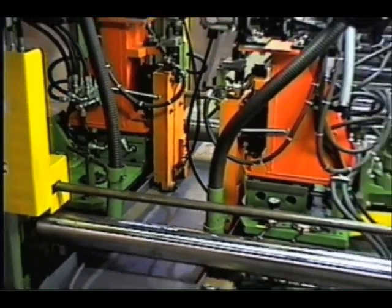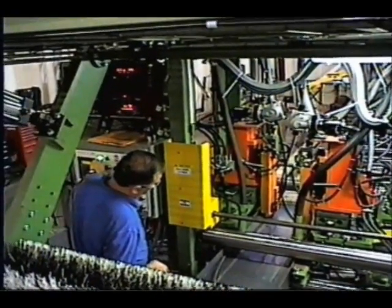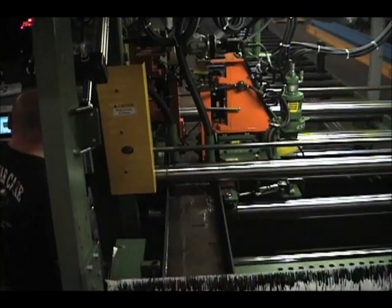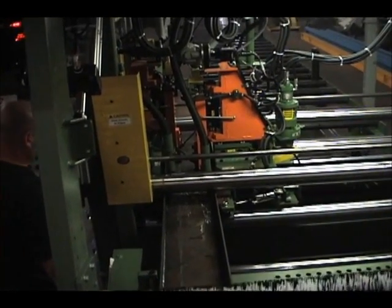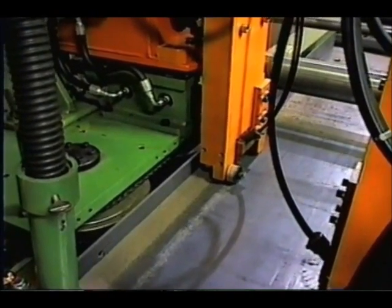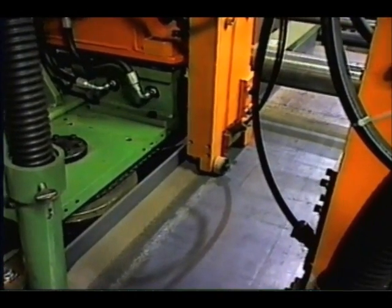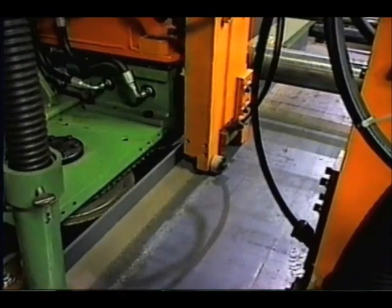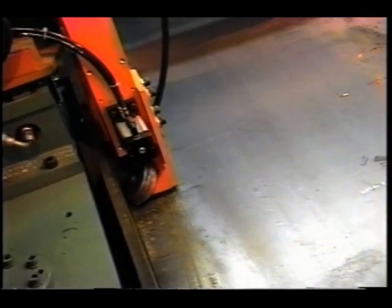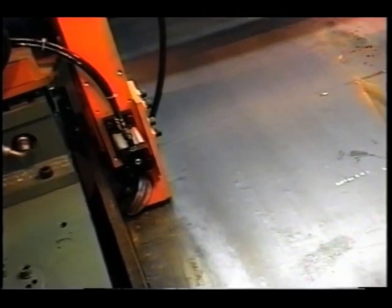The operator's control panel provides full control of each weld head with a motor-driven vertical adjustment of the contact assembly. The wire-to-corner location can be precisely controlled by the operator during the welding process. Each weld head, with its heavy-duty construction and hydraulic slide assembly, also serves as the hold-down for the web plate. The weld head pivots plus or minus 15 degrees and follows the contour of the tapered side of the beam being welded. The corner tracking wheel maintains constant pressure to the flange and web, allowing the twin wires to be positioned directly into the corner fillet.